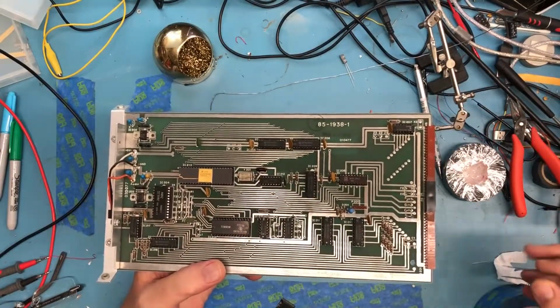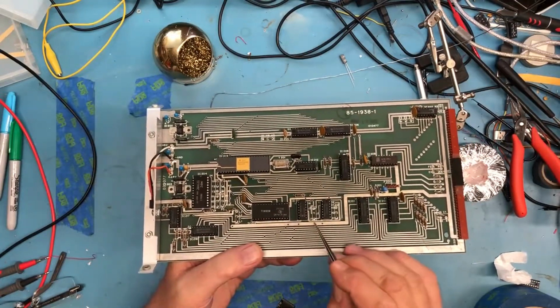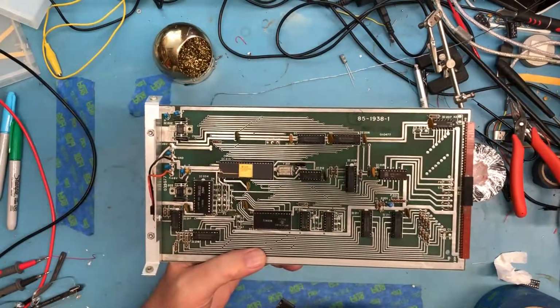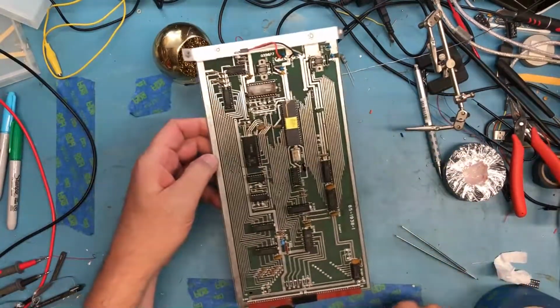So I actually missed this in the second video, although I meant to get to it, and then realized I actually need to speak to it. So part of that 4050 mod, J1 here has been cut as well. And in the factory configuration, there should be a jumper there. And so I'm just going to go ahead and take care of that now.